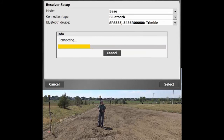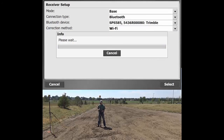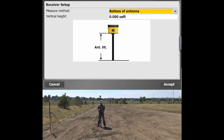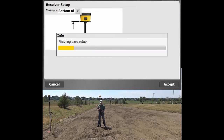It'll do a little more progress bar mapping as we connect to that base station. Here we're going to use the Wi-Fi option, meaning there's going to be a Wi-Fi network set up between the base and the rover to send correction signals back and forth between the instruments. For the setup in this instance, we're going to do base anywhere. For the measure method, just to the bottom of the antenna — we've got that nice graphic — and the vertical height. This is a fixed height pole on a bipod that we know is two meters high. Even though we're in feet, we can hit two, then the letter button, then meters, and it will automatically convert into the equivalent measurement in feet.